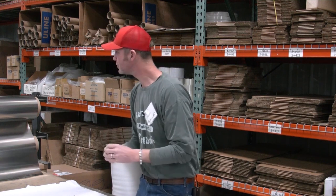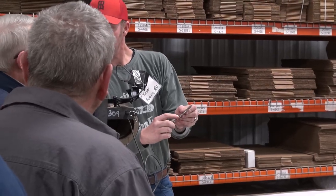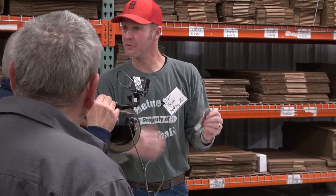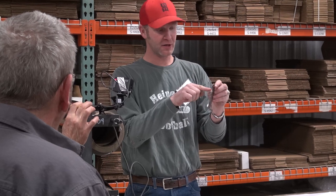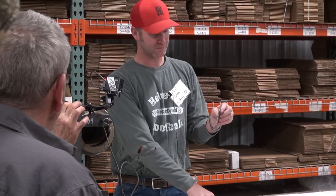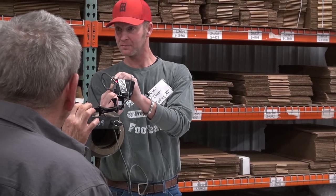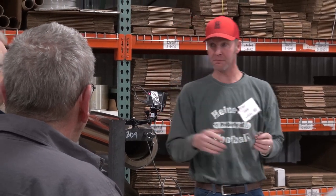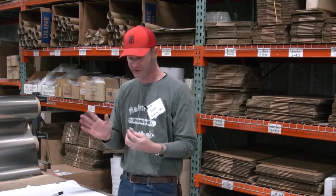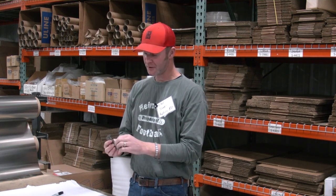Just a quick question. You say you're heating the titanium with propane. How hot? Get it red. Just get it red, and then you can push it real nice and easy over with a stick. And like I said, that far. It air hardens, and it'll never relax on you. It'll always stay there.